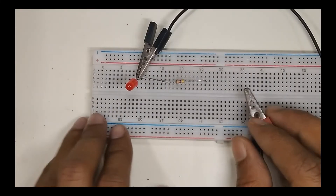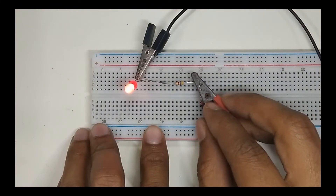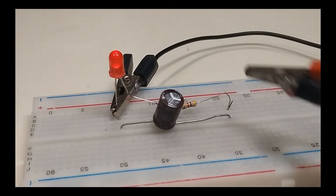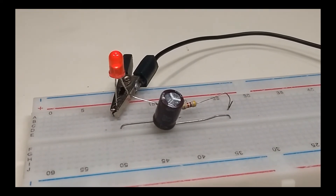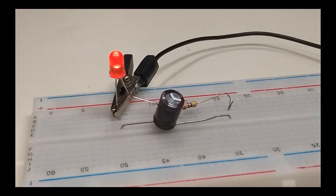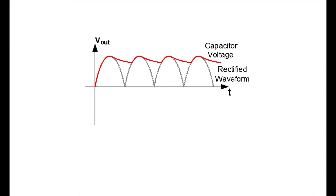In this simple example you can see the reality. If we disconnect the supply to the LED instantly, the LED goes off. But if we place a capacitor in parallel with the LED and connect the supply, the supply charges the capacitor and keeps the LED glowing. When disconnected from supply, the capacitor discharges its power and the LED remains glowing for a certain time. Through this charging and discharging method, the capacitor reduces unwanted frequency on the input voltage of the IC. We are also going to connect a picofarad capacitor very near to the IC to produce a cleaner DC signal.